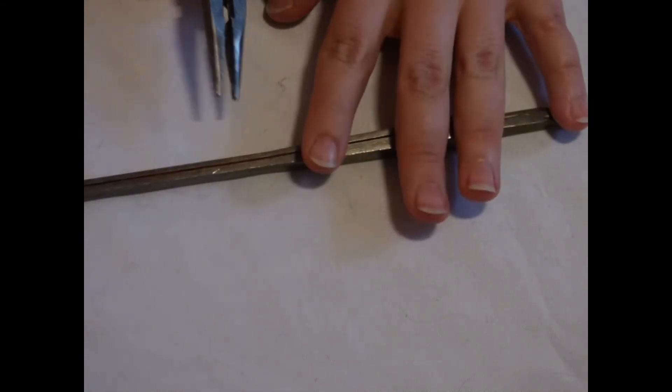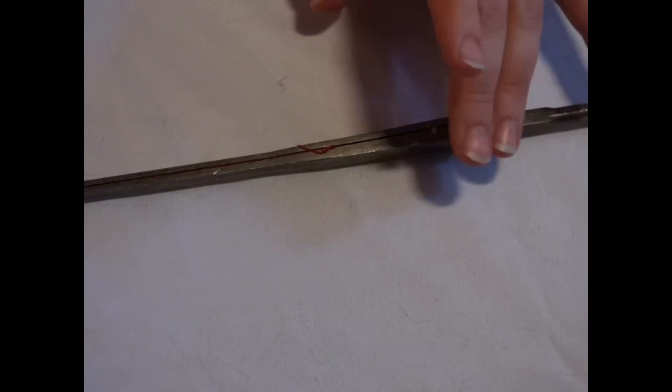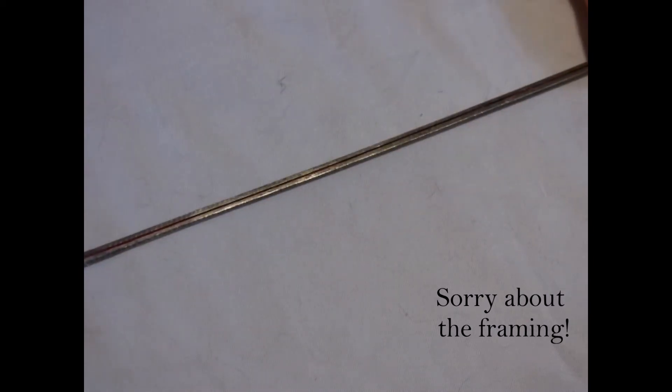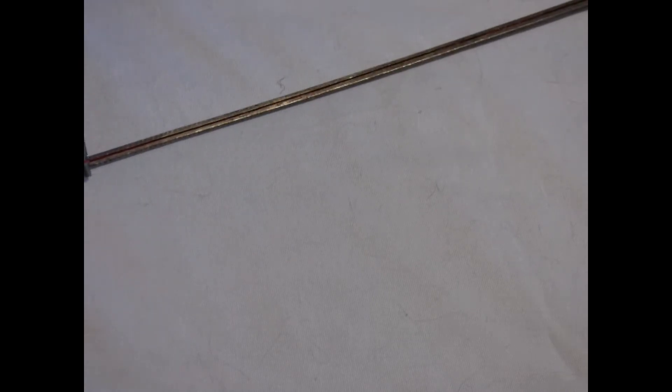If you're not lucky the wire will be stuck in the groove and we'll have to go get it out. If this is the case, the next thing you can try is to check the other end to see if there's enough tail there to grab. In this case we're lucky — there is plenty of tail here that we can pinch and start rolling up this way.